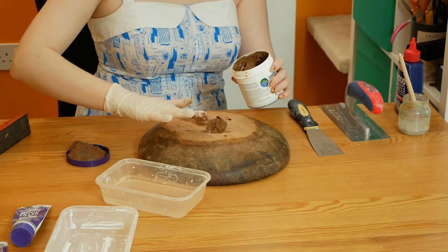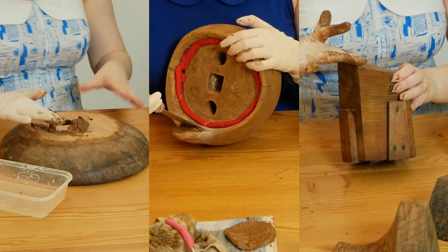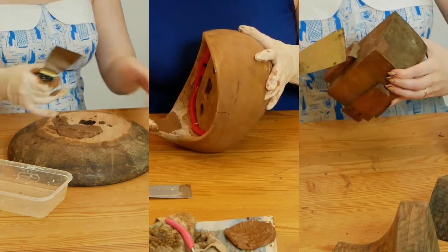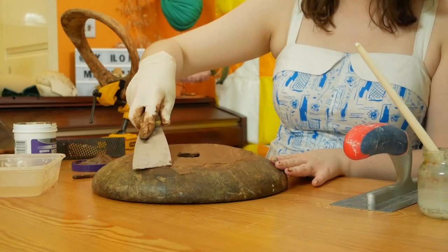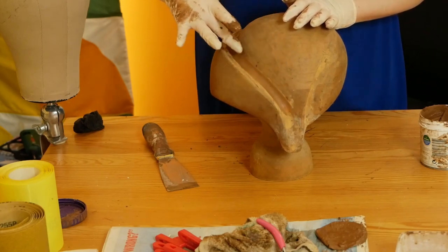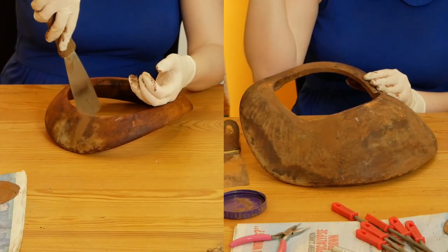After the preliminary sanding it's time to fill some dents and cracks. I'm using a dark coloured wood filler to match the colour of the wood, as lighter colours tend to have an unsightly orange tinge. Pretty much every block needs some degree of filling. When using filler it's useful to have a container of water nearby and to use a spatula. Larger dents will need several layers and you must leave it to dry in between each application — the rounded saucer brim needed three layers. For the two brim blocks the filler will also help disguise the wood glue join and give it some extra reinforcement.